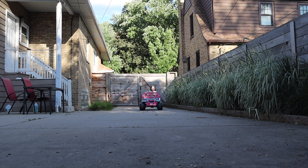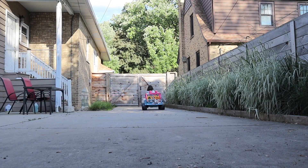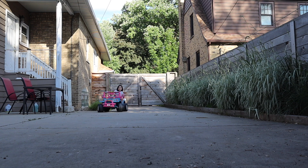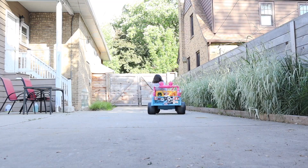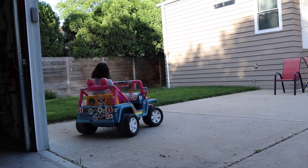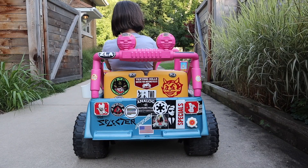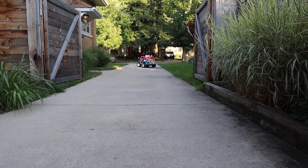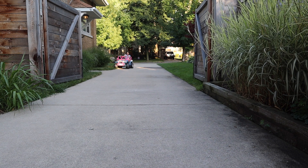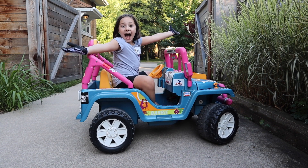So that's about it. The batteries are secure, they charge in about 90 minutes instead of overnight, and they boost power by nearly 65%. The speed controller was a pretty good idea too — at full speed it's easy for her to overcorrect her steering and end up in the neighbor's grass, though she has mastered the power slide and can drift around tight turns. To keep her off the neighbor's lawns and for my wife's peace of mind, the kid doesn't even know about the speed controller, and I keep it set at around 75% output. Subscribe and check the description for links to the components used in this project. Booyah!